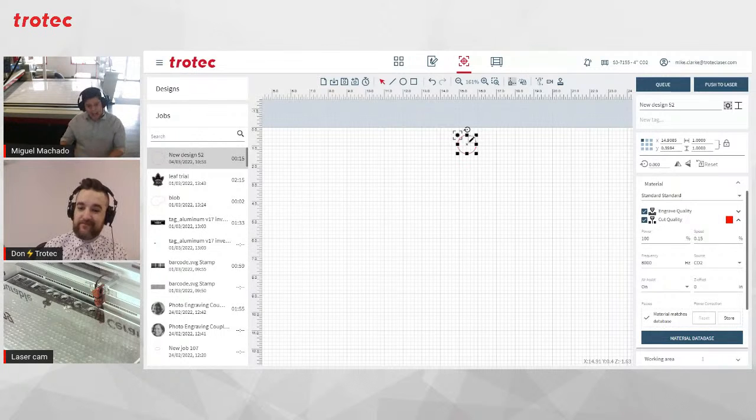And still it could happen, because there's not enough time for the laser to move and not catch the gas that is releasing from the acrylic. So it is kind of an inevitability. You can get better equipment and make it work, but if you're cutting acrylic all day long, it will linger. And that's what we're trying to do here: make sure that it doesn't catch fire, doesn't burn the acrylic, doesn't mark it, doesn't break it.